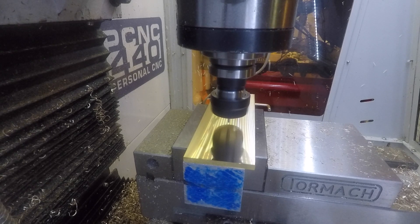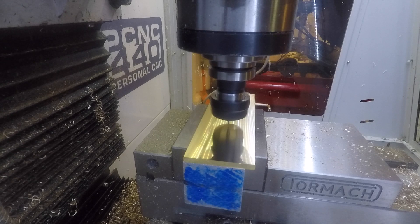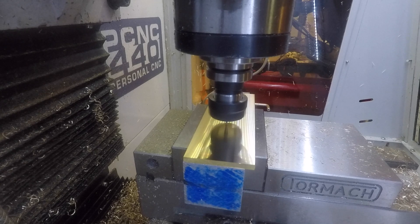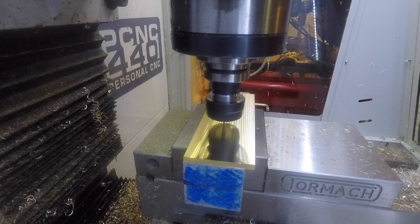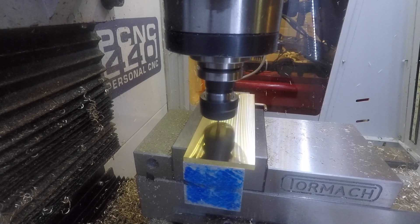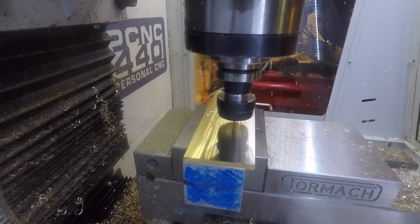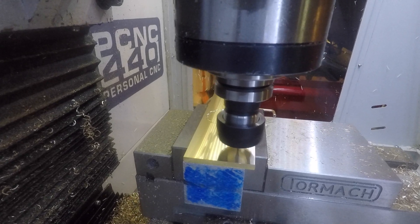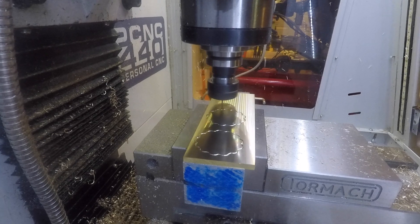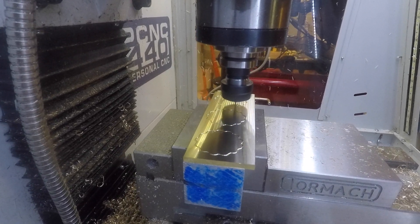This tool is a 1/16 inch ball end mill which we're going to use to cut a nice groove around the edge of each coin. The ball end mill is not perfectly designed for this kind of slotting so we're going to go very slow. This is 20x fast forward.